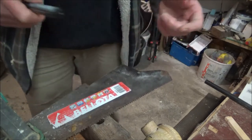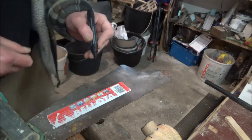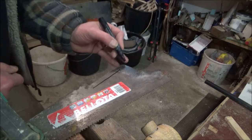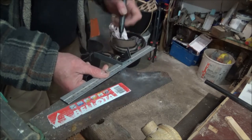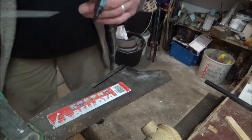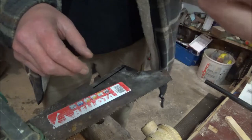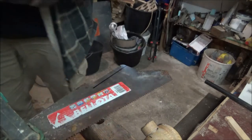Into the shed — I've got this saw and I'm going to make another spoon knife. The other one I made was a little bit too hard. I'm going to take that off with the grinder, shape it up and turn it into a spoon knife. Hopefully this one will work better. The other one I wanted more curled — I had it too straight, which meant I was working like that. This one is going to be left-handed because I am left-handed.